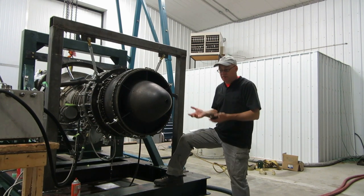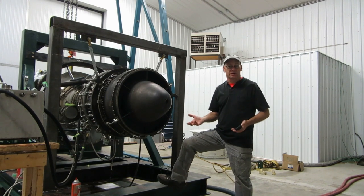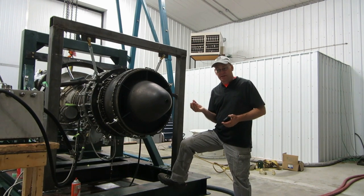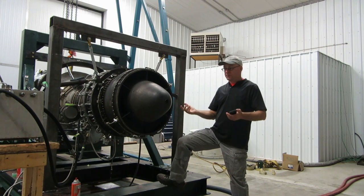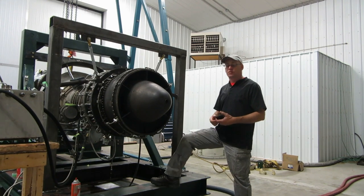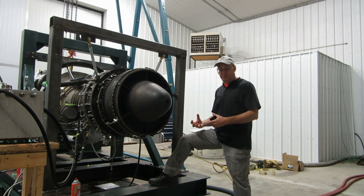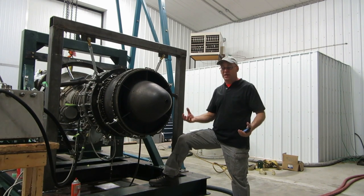There's 5% energy left in the exhaust gases that couldn't be captured by the power turbine. On a big helicopter engine that little bit might be 500 to 1,000 horsepower — something. Rather than accelerating that into an exhaust jet and causing the helicopter to fly sideways or backwards, you want a helicopter to be able to hover. So the exhaust pipe on a helicopter specifically wastes that energy — turns it into heat and sound. You could put another power turbine in there, but all that weight and expense would not be worth it.